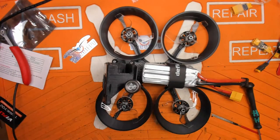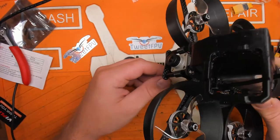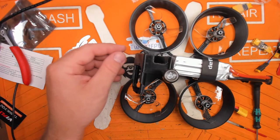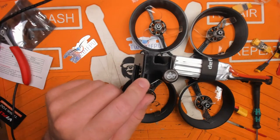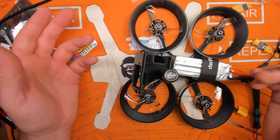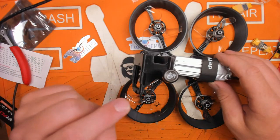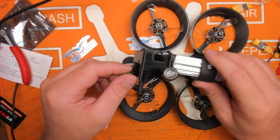For this, on the other hand, seeing as it's going to be cinematic, the lower the camera angle, the slower you're going to fly. If you point your camera angle down, you'll end up actually naturally kind of wanting to fly backwards. So just slow around the house, maybe 10 degrees, maybe almost flat. But if you're recording with a secondary camera like a GoPro, you need to kind of think about where that's going to be. In general, it's better to look at more ground than sky. So you would want your FPV camera slightly higher than your HD camera. But then again, everybody's artistic style is different. So there you go.